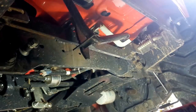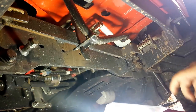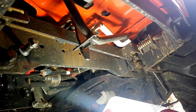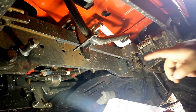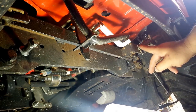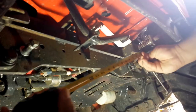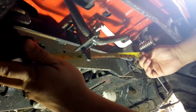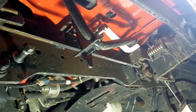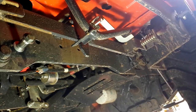We're underneath the tractor. The install instructions tell us to measure forward from the mower mounting spring pins — I'm assuming this is the mower mounting spring pins. It says to measure about 16 and a quarter inches forward. I did that and found some holes in the existing frame that we are going to use, and that's where we install the supplied bushing, bolt, bushing, and washers. We'll do the same thing on the other side.